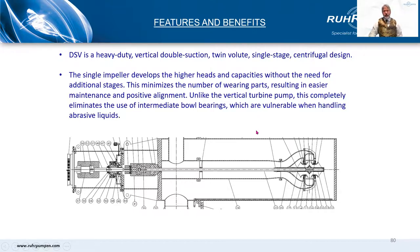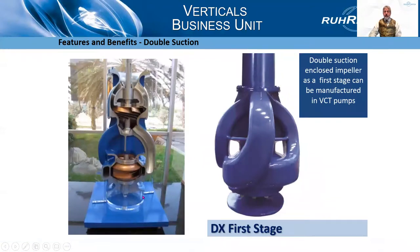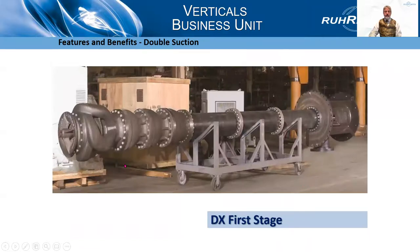So it can be vulnerable when handling abrasive fluids, though we're seldom handling abrasive fluids with a VS7 — it would normally be in clean service. The mid-range here is 2270 cubic meters an hour and 90 meters of head, so it's a big pump. Shown here as a two-stage pump on the left with a mixed flow second stage, and as a single stage pump on the right — double volute design so four discharges combining into one outlet. And here you see it as a first stage in a multi-stage pump with diffuser series stages.